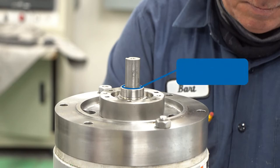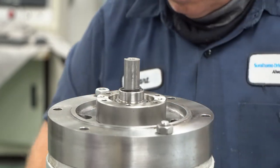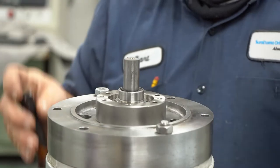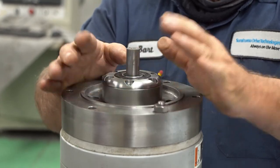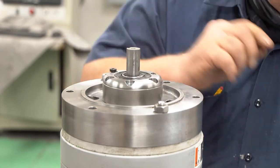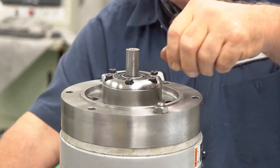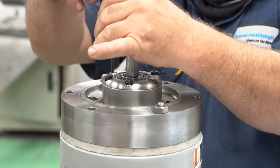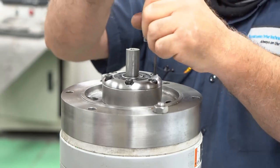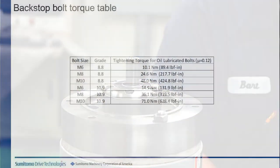After the installation of the collar, you should see the groove where the retaining ring will be installed. Put the snap ring back using the snap ring plier and push all the way in. Then the cover and seal assembly goes back. Tighten the bolts and washers, and use a torque wrench to torque down the bolts according to the table shown.